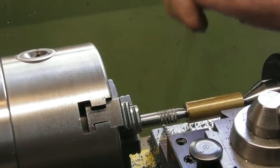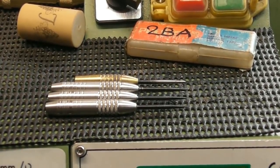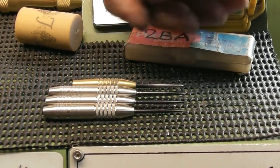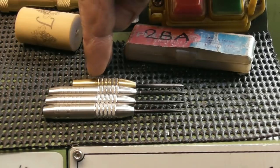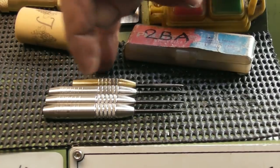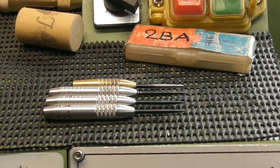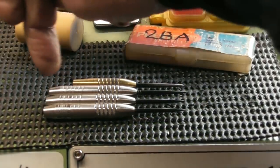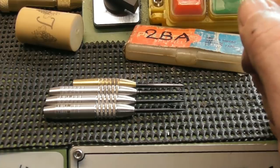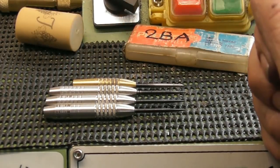So my final step is going to be to cut the taper on the back end of these. Let's have a rethink. What's the story so far: we've got everything shaped on the barrel up until the last groove, we've got them drilled out all to the same depth as the original, we've tapped so far down with the 2BA tap — they'll have to be finished off with a bottoming tap when I've cut them off. I think that's probably it for this episode, so there'll be a Part 2 coming soon where I'll be parting off what's left and turning the taper on the back. I may have to make a little 2BA stub arbor — I might see if I can find an aluminium dart shaft or something like that to screw them on. It's only a tickle to finish off this size.